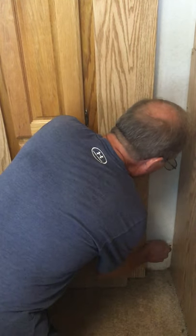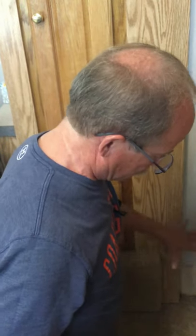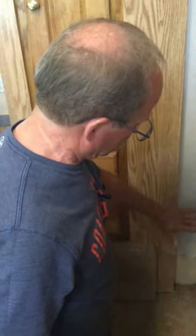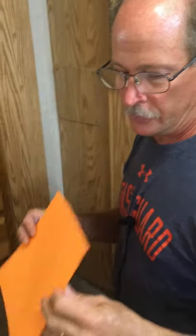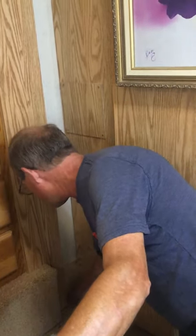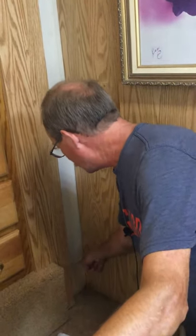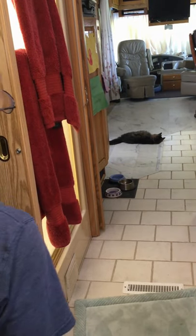After the 100 grit I'm going to the 180 grit — a little bit finer — and do the same thing all over again. Now I'm done with the 180 grit; moving to 220 grit sandpaper to get it as smooth as possible. Then I'll vacuum out all the dirt and sawdust and get it generally clean. Next I'll mask it off so I don't get stain on the carpet or walls. I got a piece of thick printer paper to put underneath the wood between the carpet and the wood to protect the carpet and keep a straight edge. Then masking tape up the sides and newspaper around to contain the spray mist.